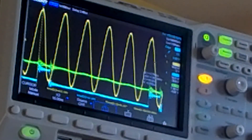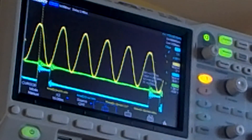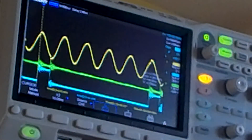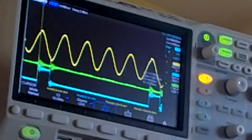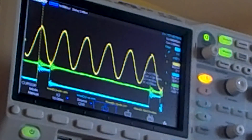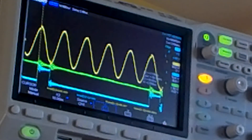When I reconnect the capacitor to ground and move our receiver closer to the transmitter, then we see that we have a difference in phase, so I need to change the frequency accordingly. And again we are now at 177.4 kilohertz, we are back in the middle. But you can see that the amplitude is lower; on our receiver the amplitude is a little bit higher.